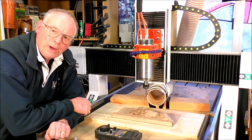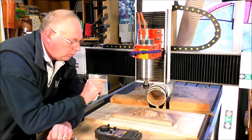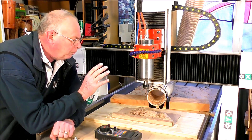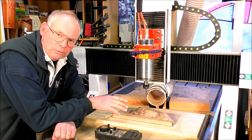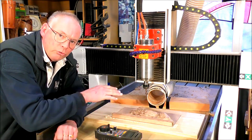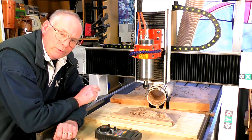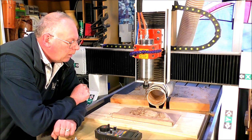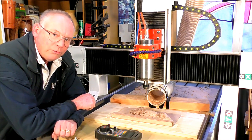We now have an interesting problem. From the original video I made in Vectric Aspire, I changed the roughing toolpath to a 3D roughing toolpath - that's why this is following the contours of the lyre. We have now machined all the material away to the height of the original top of the material.